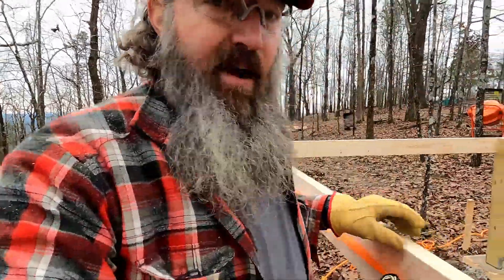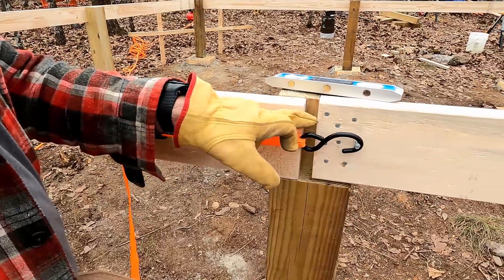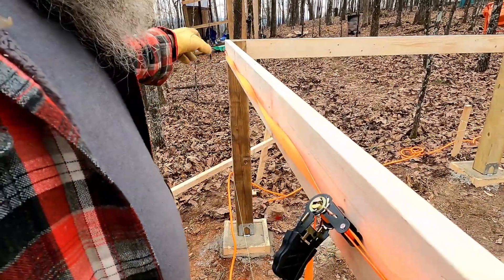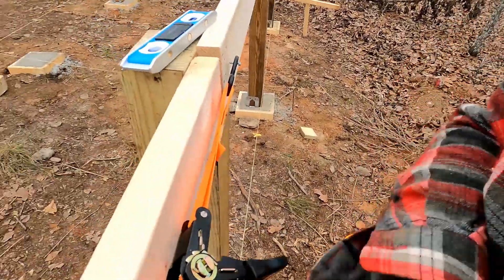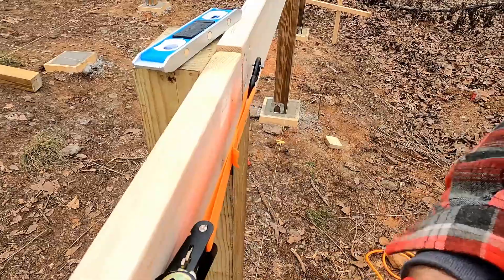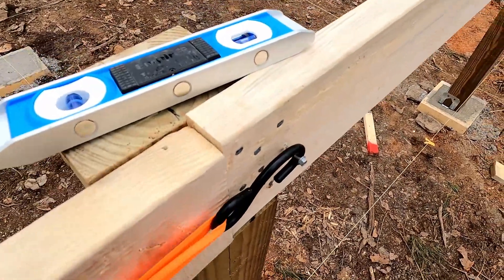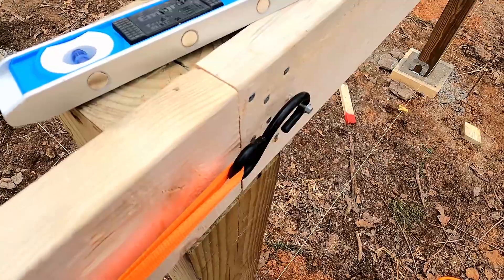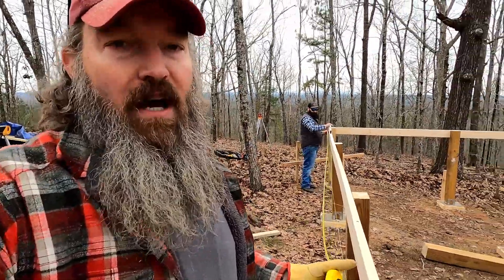We were talking about pulling wood together — so here I'm trying to put that 8-foot piece together and I've got to pull this together and lift it up to get it level. I've only got two hands, I'm by myself. So ratchet strap — put a couple screws in and I can just screw it in. Let's do the ratchet strap. Look at that — no struggle. Close that gap up nice. Now I'll be able to lift it level without having to pull. That's so much easier — consider that if you're trying to make something fit.